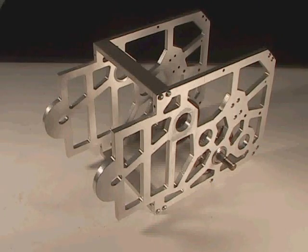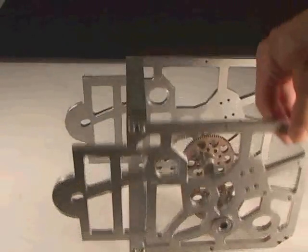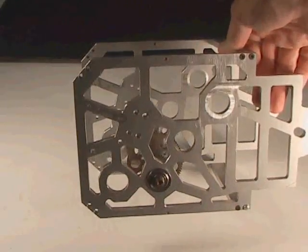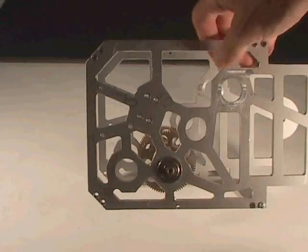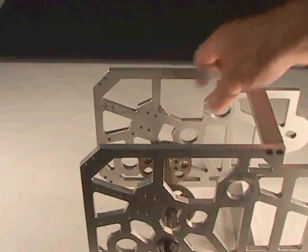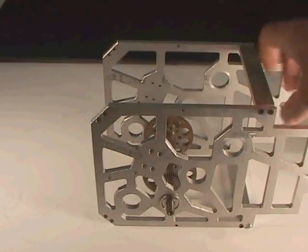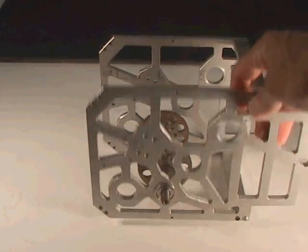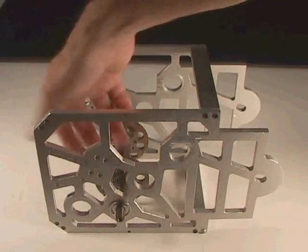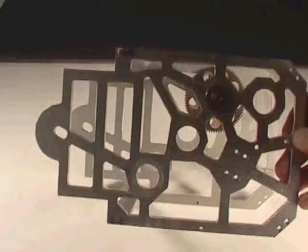Let's take a look at some of the parts you can make on one of these CNC milling machines. This is a gearbox — actually a prototype gearbox made for the First Robotics competition a few years ago. These two identical plates hold circular cutouts created to hold ball bearings, with shafts going through them and a couple of gears mounted on each shaft. The gearbox was never fully assembled, but it had the ability to shift gears and allowed the robot to move. It's a plate with a lot of hollowed out sections — the kind of thing you'll learn to program on the CNC milling machine.